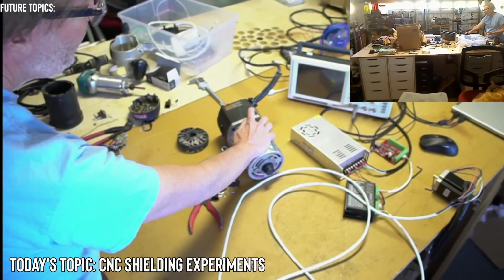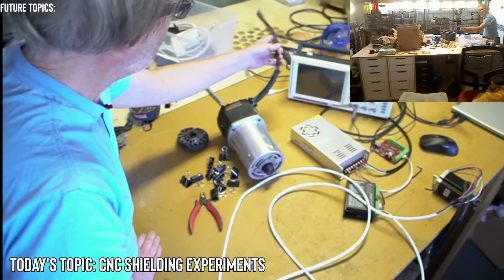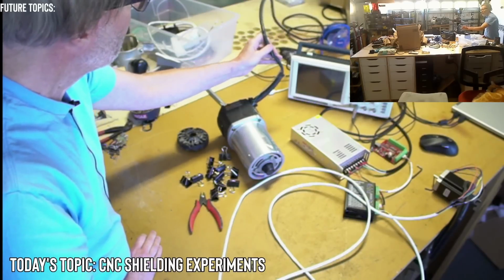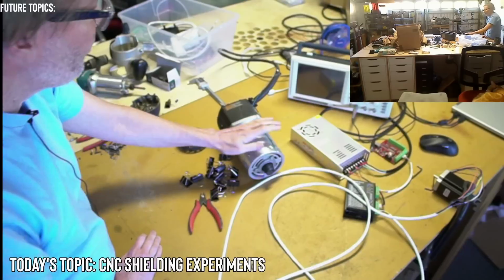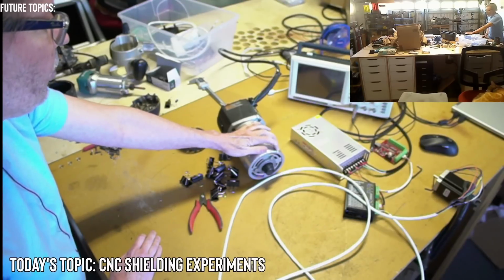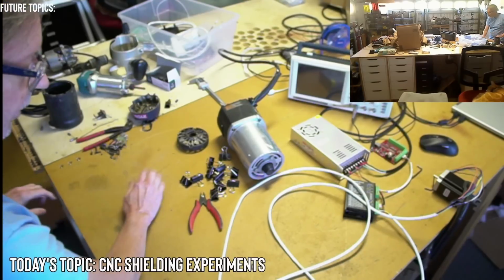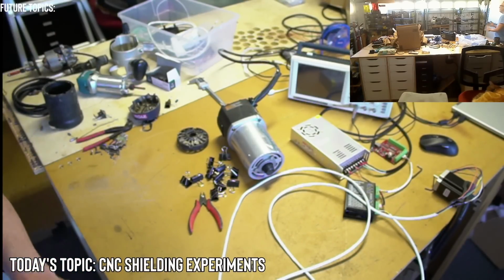And my thinking is that the AC, because that had a lot of voltage peak to peak on this cable itself, maybe that was overpowering any spikes that we're getting from the router. So let's just do that real quick. Let's just run the router and look at it on the oscilloscope, just to get a reminder of what the condition was.